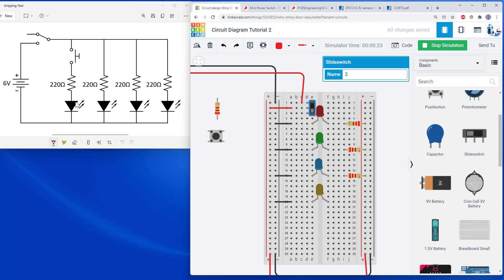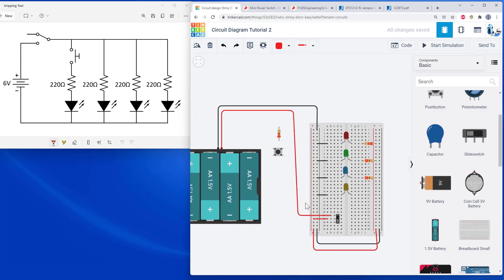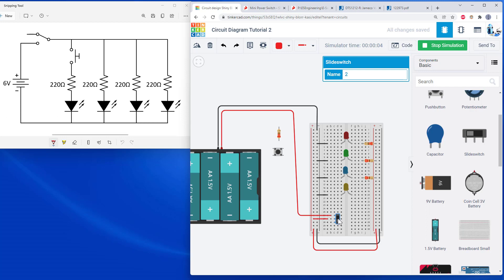Before connecting the button, this is a good reminder that the physical layout of the circuit does not need to match the circuit diagram. It's just a coincidence that the switch is in the top left of the diagram and I also put it in the top left of the breadboard. I could put it in the bottom left instead, rerouting the wire all the way down. Electrically there's no reason not to — it functions exactly the same — but physically it could get messy when routing battery pack wires.